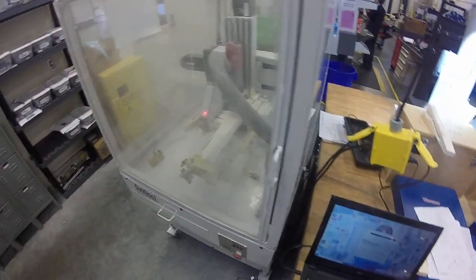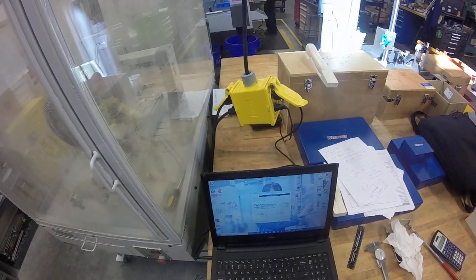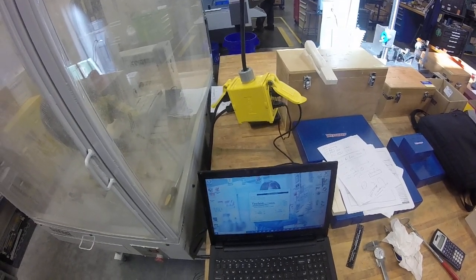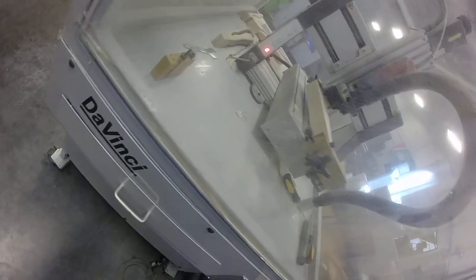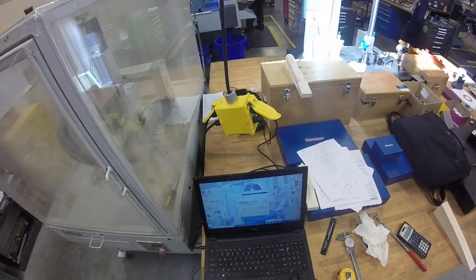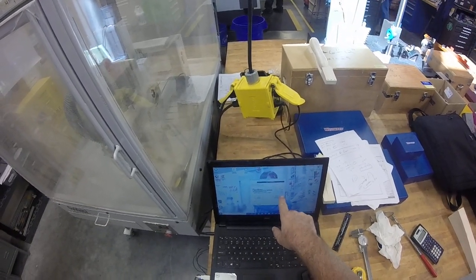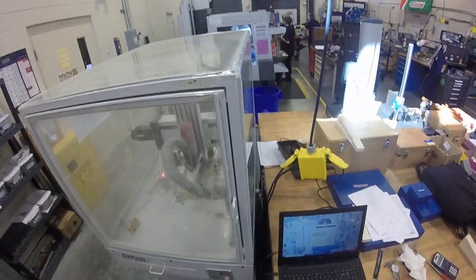Moves, it says right there, move to offset position. There you go. Our cutting, and same thing, I'm a little aggressive with the feed rate, so I'm going to crank these down to like 350 and 200-ish. Turn my vacuum cleaner on. Looks pretty good. And that should run for a while. So we're at negative 19.171, so our final cuts are going to be at minus 37. That's the Z-depth boundary that we set. Okay, we'll let that run and we'll come back after we've done the project. Thanks again.